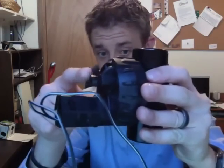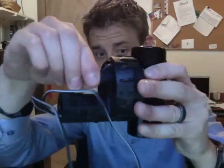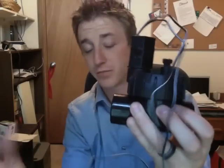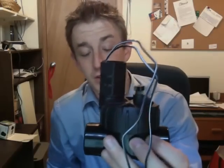On the top of the valve, you're going to see, oh, good. Here, okay, you're going to see a bleed screw. Okay, and in that bleed screw, if you loosen it, what that does is it releases the pressure on the valve and actually opens it. And sprinklers will come on. If it's the sprinklers that are seemingly leaking, then you know that's the valve that has to be fixed. If it turns on sprinklers somewhere else in the landscape, great, you know that valve doesn't have to be fixed.